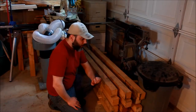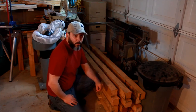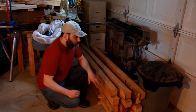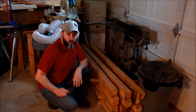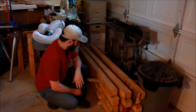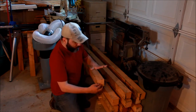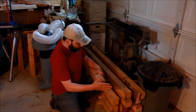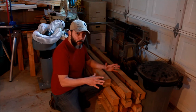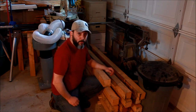This is the reclaim wood that I have — it's all fir, very close grain. The thing I like about fir is that it's very stable once it's dry. Now I already hear you guys saying fir for a workbench top — well, I already have the oak and mahogany workbench, so all the hammering and pounding is done on that one. The other one is mostly for an outfeed table. So the first thing is to plane it — I want my grain direction to be vertical for the top of the workbench. I want to line up all my boards in the proper way so once I'm done with the glue-up I'll be able to plane it down with a hand plane with all my grain direction going the proper way.